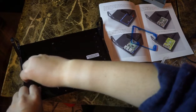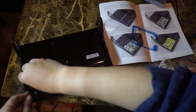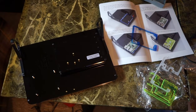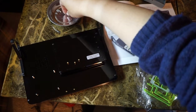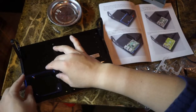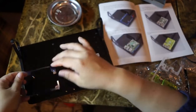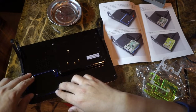Mounting your Raspberry Pi 4 is fairly easy. You basically remove the four little screws on the tops, and you're just going to layer the mounts provided for you — blue first, then clear plastic, and then the green tops it off. It's kind of like a very low-profile case that's really just there to protect the device, but it leaves a lot of stuff exposed, which is fine for keeping the Raspberry Pi cool.